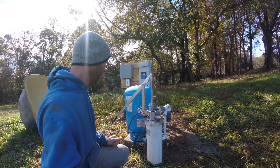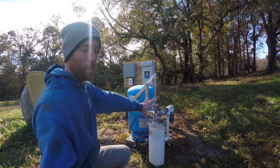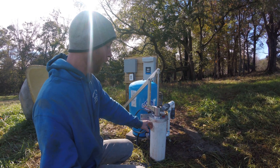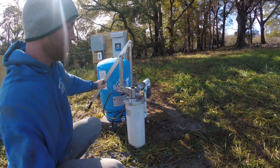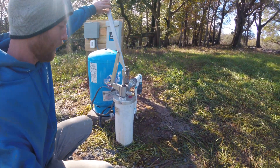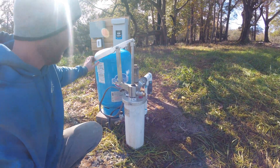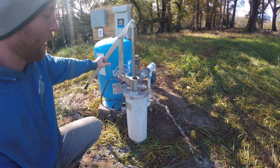If you're wanting to do this setup with an irrigation pump and a hand pump and have everything freeze-protected except when you want to use the hand pump, the casing really needs to be about a foot above the ground. That way you can raise the cylinder up and get it where you want it. It still works fine — got the little weep hole down there — it's just a little lower than you'd ideally like for it to be.